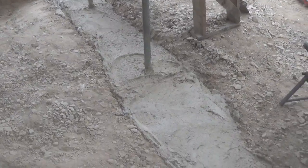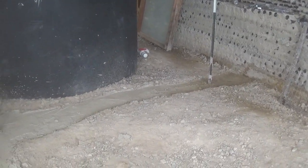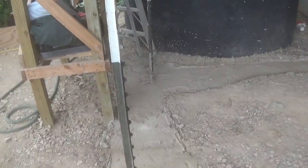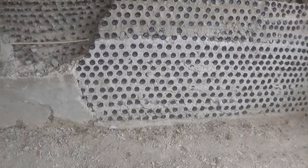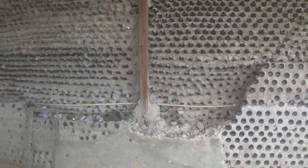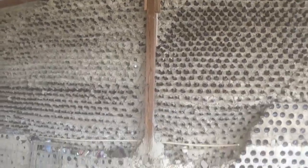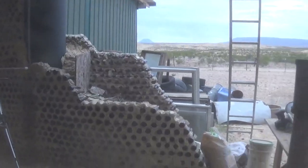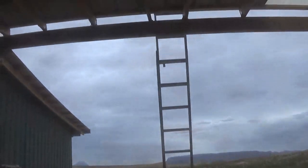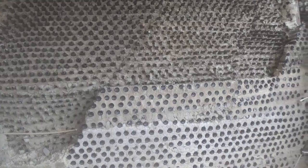However, it'll hold the cistern and over 10,000 gallons of water. It's always a good idea to do things as good as you can, but there are also times when you have to realize you have limited energy or time. Something like this footing will work perfectly well, particularly if you're going to be doing bottles, and that's what the cistern is going to be built out of. This ends part one of the cistern build, and it's going to be a while before we do part two. I have to finish this wall all the way up, come around and hide that tank, and finish the other wall before I can start on these outer walls.